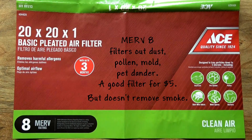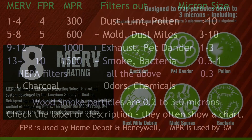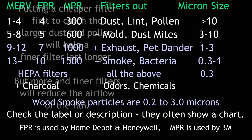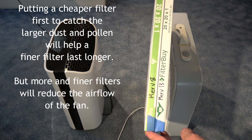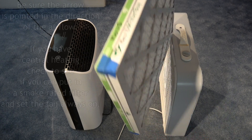A lower fan speed may help the MERV 11 be more effective. You can pick your filter for your purpose — cheaper dust and pollen filters are only about $1 to $5 and will filter out sawdust in a shop or dust in your house. A 2 or 4-inch thick filter will allow more airflow than the usual 1-inch but will cost more. You can stack a cheap filter in front to catch dust so the more expensive one lasts longer. Be sure the arrow showing the airflow is going in the right direction.